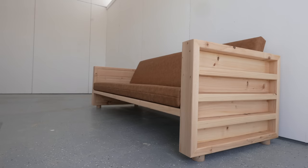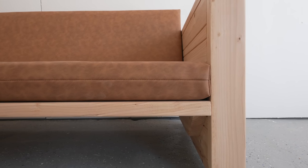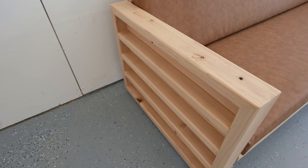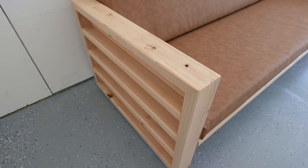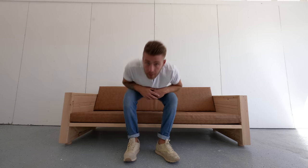I am really happy with how this project came out. First of all, I had great two by fours to choose from — they were really straight and had nice color and grain. Beyond that, I did a great job with my circular saw joinery and didn't have to use too much wood filler to get a really clean look. Overall the sofa is really comfortable; if you wanted to lounge back a little more you can make the seat bracket 10 degrees just like the seat back. The color of this vegan leather on the Simple Cushions couldn't be better.